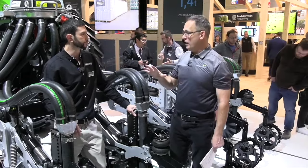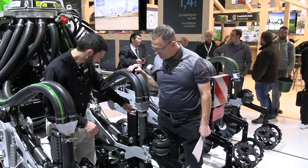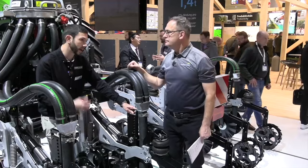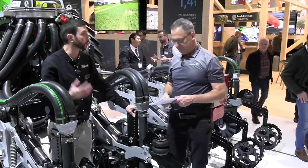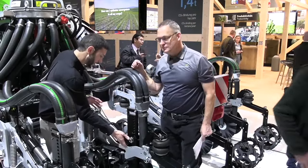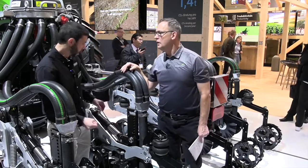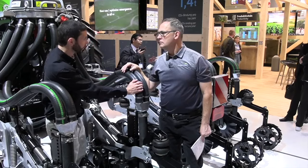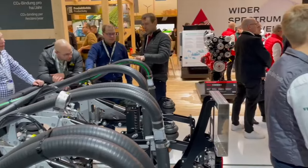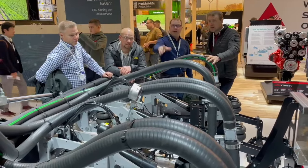Let's talk about managing trash — a lot of no-till, going through a lot of corn stubble. So for trash, we rely very much on the CleanSweep row cleaners. As they are in-cab controlled, the operator can make very fine adjustments to make sure all that trash is out of the way. We have good clearance at the bottom of the leg and the shank to make sure trash is flowing through. This machine will also do slurry applications — applying slurry at the bottom of the leg, making sure it's buried and the corn and soil plant can grow into it.